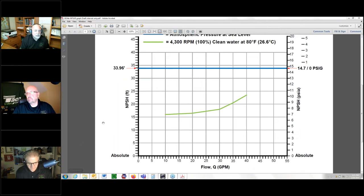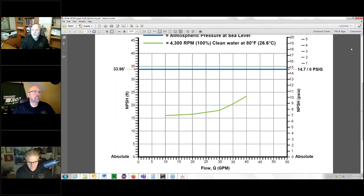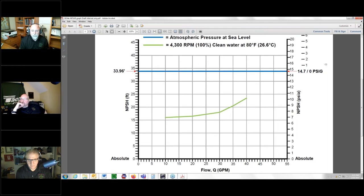All right, so let's pull this over a little bit. As long as you can see it, I'm going to shrink this back. So, for instance, let's use that example. By the way, that 18 PSI is a typo, unfortunately. But even if it were 18 PSI, let's think about that. Dave was talking about absolute pressure before, when we were looking at some of that information he was showing you on solubility. But understand, absolute pressure is not 0 PSI gauge. 0 PSI gauge is actually 14.7, okay?